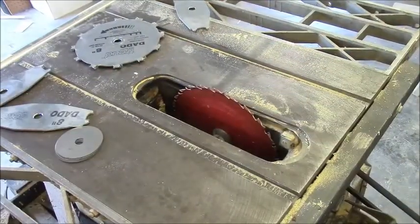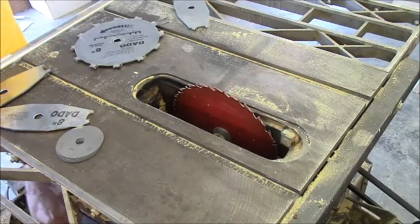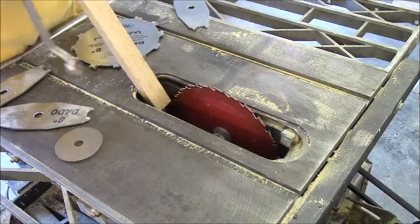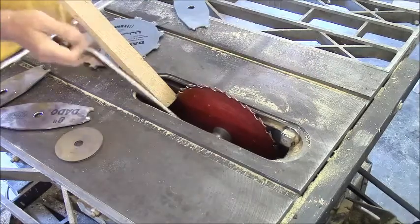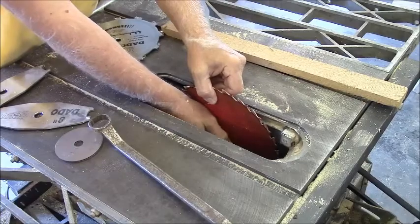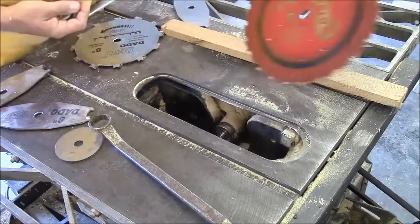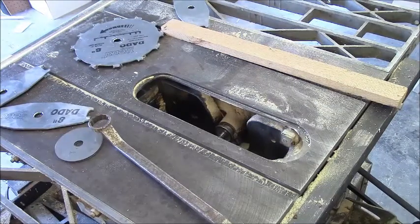Alright, so first thing you do is unplug your saw. I'm just a geek. Anyway, this wrench is 1 1/16. Put my wood in there, put this on the nut, bust it loose. Alright, this is a great blade. I've used it for years. It's a thin kerf. It's probably a little dull. Thin kerf Diablo, Freud 10-inch 24 ripping. I've used it for everything, and it works perfectly. I probably should send them out after this project and get them all sharpened.